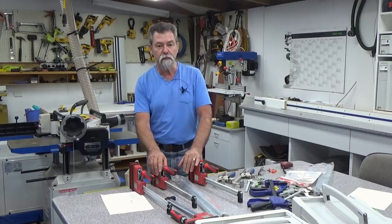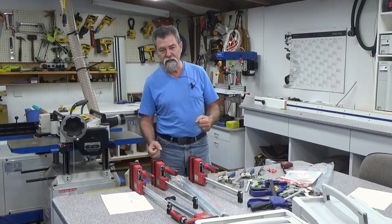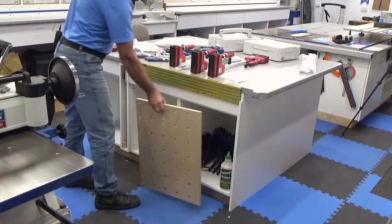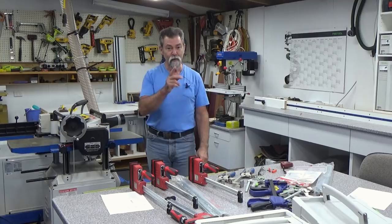And as an interesting twist, I'm going to make all of the drawer fronts act as a 96 millimeter regular 20 millimeter diameter dog hole pattern. So it'll be quite nice. I'll make some nice ply drawer fronts out of this kind of stuff here. I've also got an interesting twist as we go along. So keep watching. At this one, you may pick up some very, very handy ideas.